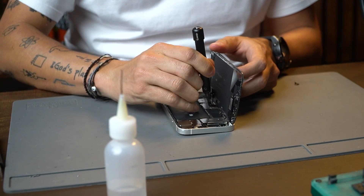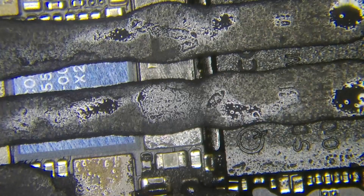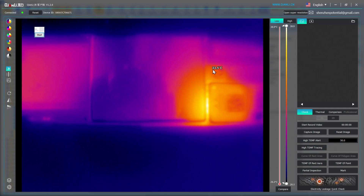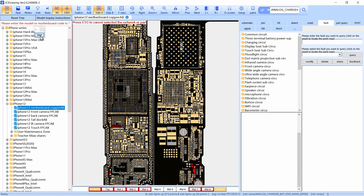I'm going to take the board out of the housing and then we are going to check with the thermal camera to see which circuit is bad. I have my thermal camera and my board. I open the tool, power on the power supply, and we can see there is heat right here in this section. So I power off and go to my schematics. We are seeing heat on one side of the board, and on the other side we have this component — for me, this is the one that's bad. That's why we are getting the consumption, because this one is directly connected to the battery.